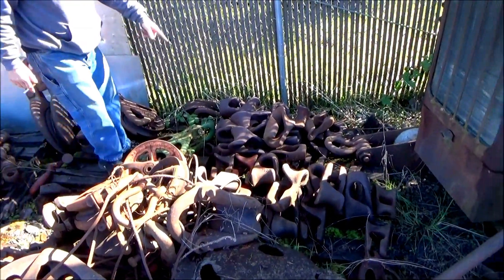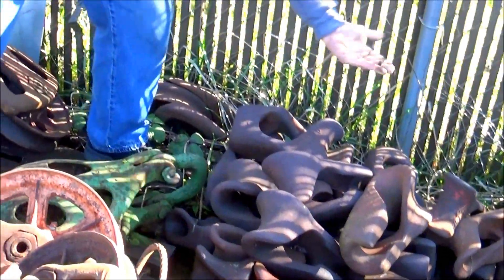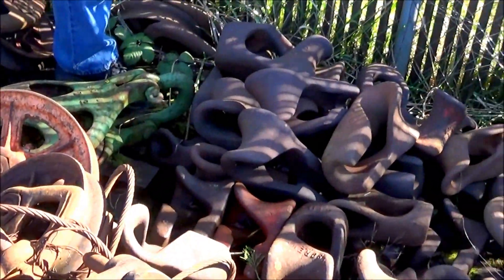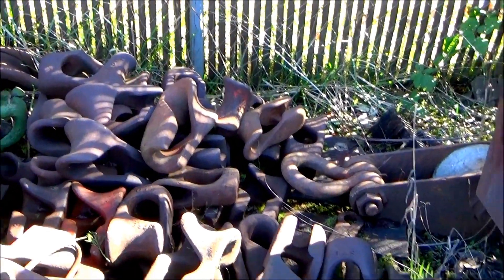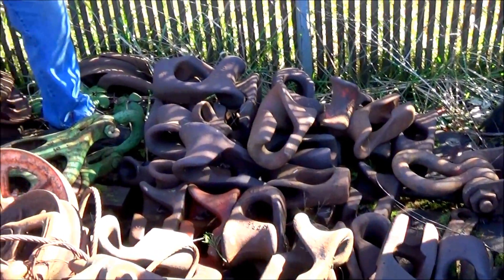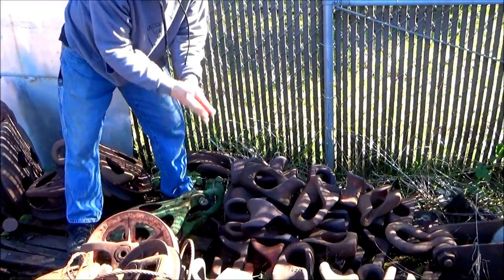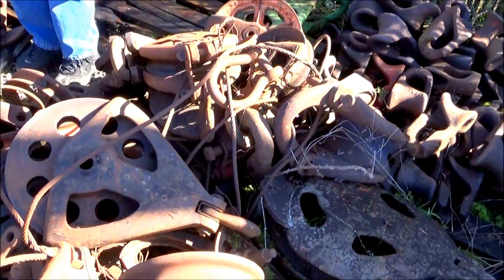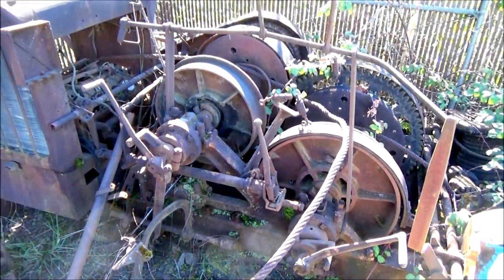Here are the screwy bells for the guy lines. They call them screwy bells because you can take your guy line, wrap it around the stump, thread it through, and snap it together — you don't need a bell. The reason it's called screwy is the way it curves. Your guy line rides through there, the bell comes out, and the knob comes up. We still use the screwy bells. When we log with the link belts that's what we used on the main line of the skyline.